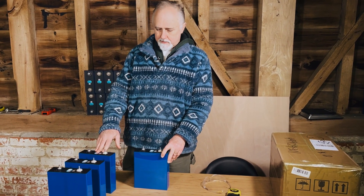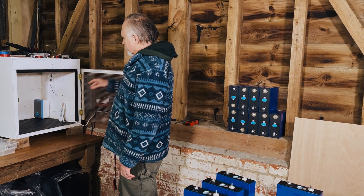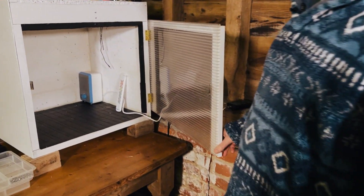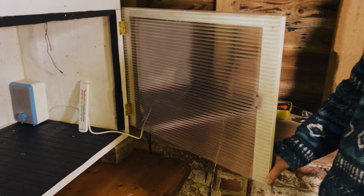I'm going to put these in and show you this booth over here. This is a constant temperature booth — we've got a little heater and a thermometer in here. It's sitting at usually between 20 and 25 degrees centigrade. The idea is that it's unfair on the manufacturers to test at too low a temperature. This barn is about 12 degrees, so it wouldn't be fair to run a capacity test at that. We've got four individual testers to test each cell separately.